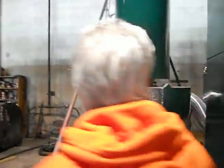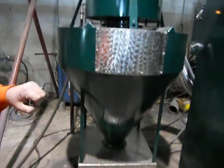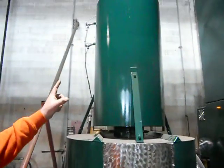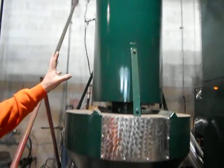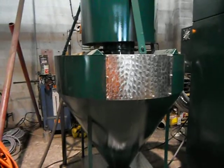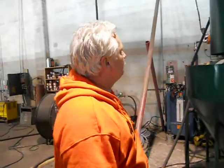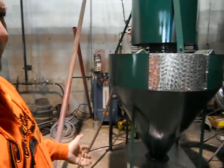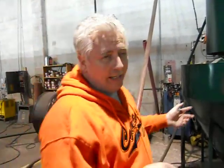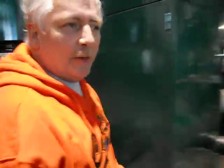This right here is our cooling unit — it's kind of a unique deal. This is actually attached to the cooler, and it has a catalyst in it also. This is optional equipment. If you're in an area where you have to burn your cooler smoke, this is the way to do it. It's tied in so we can automatically run it with the roaster, turned on and off. If you have a catalyst unit on your cooling, you're also going to need a chaff cyclone — even a little chaff can cause you trouble with your catalyst.